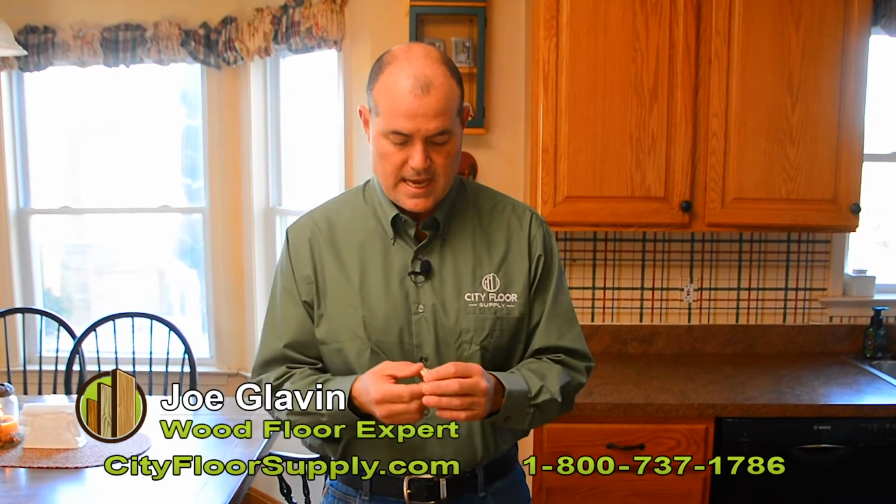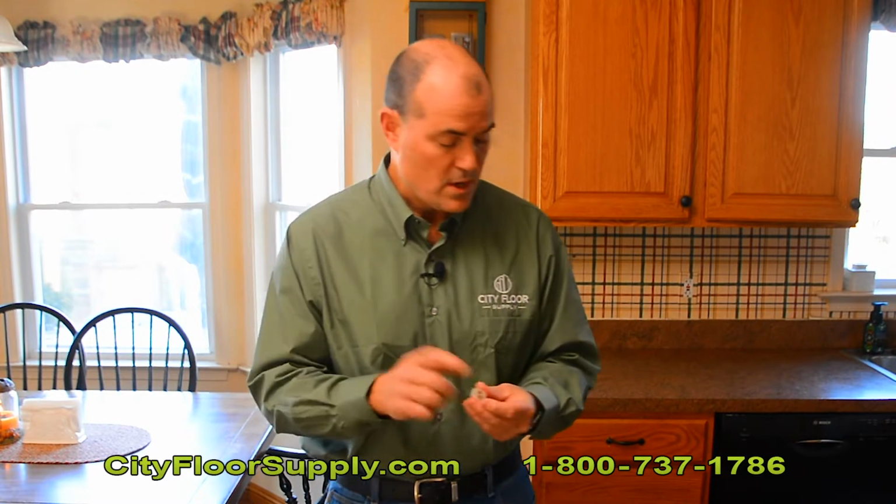The other thing that happens is when you tap this into a wood chair, eventually, because of expansion and contraction and relative humidity and temperature, the wood of the chair leg changes, and these loosen up just like anything, like cracks around your door frame or just about anything. So you'll have to reinstall these. Well, when you reinstall these, you kind of have to move to a different spot, and eventually the bottom of that chair is going to get damaged.